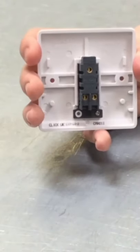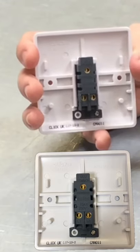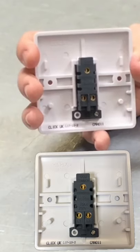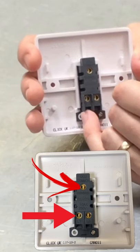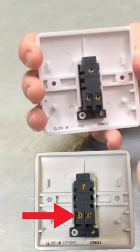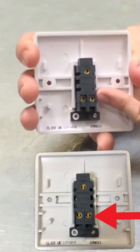What we've got on the back here indicates that this is a two-way switch — we've got three terminals, and all of those terminals have got connections inside them. They're labelled: Common at the top, L1 at the bottom, which would be the equivalent of the one-way terminal on the previous switch we looked at, and now we've got a third terminal marked L2.